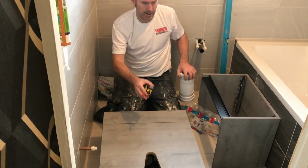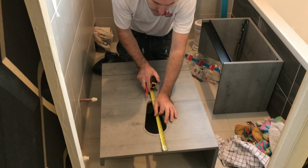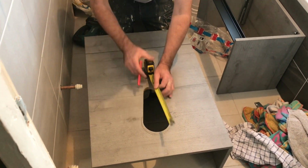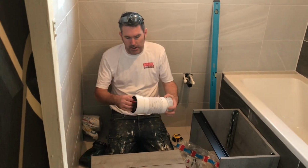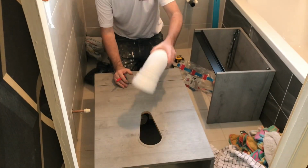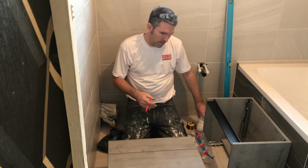and you'll get it. Now from the bottom, they always centre them, 7 inches says centre. So you know it's going to be high enough, you know that's in the centre of the toilet, cut your hole out, and then when you get your flex on, onto the toilet, it'll push back into that hole properly, otherwise you'll have a lip. That's just a handy tip from MJC Kitchens and Bathrooms.